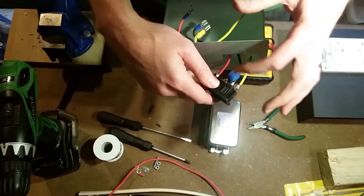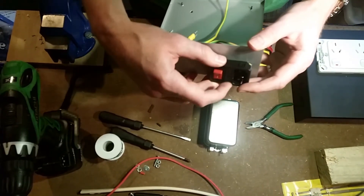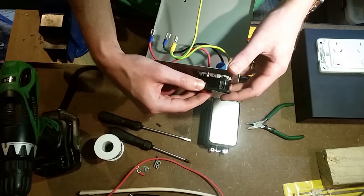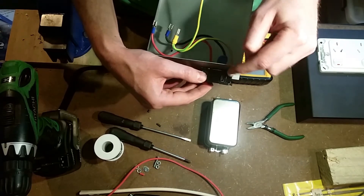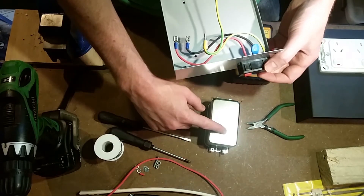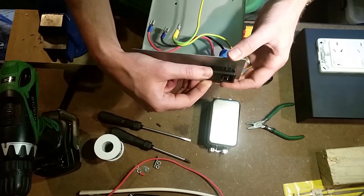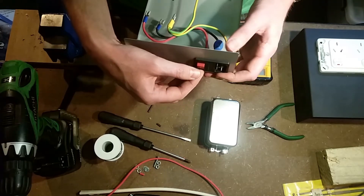In that time it should have connected enough amps to blow that 10 amp fuse. The fuse should always be the weakest link in the circuit so that everything else is protected. The varistor is there to make sure that the fuse actually blows, instead of the filter or whatever is plugged into the line conditioner being damaged in case of a power surge. So that all clips into there nicely — looking good.